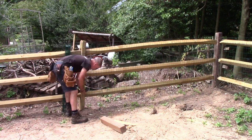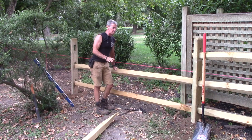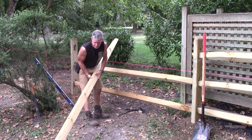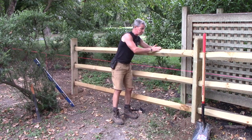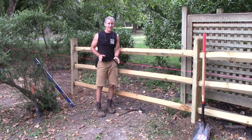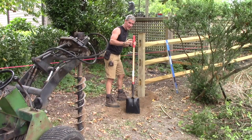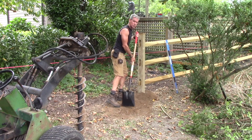Twin rail fence! There's not much to setting rails on a split rail fence — into the new post, back to the old post. But as I set these posts and rails, I'll tell you something: whoever invented a split rail fence — kind of the commodity fence of the fence world — they really knew how wood works. Peak side is up, everything's wedged together. These tapers are really complicated; it's hard to mimic them with a chainsaw when needed. And it all sits nice and tight without any fastener. I'm impressed, Mr. Split Rail Fence Inventor Guy — or girl. Because there's only one of me, I like to do as much as I can in a segment, so I just backfill the holes as I go.